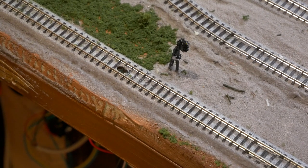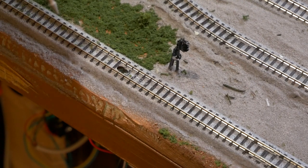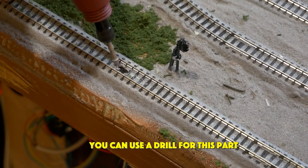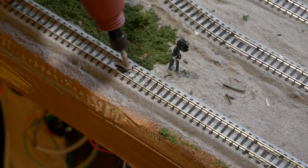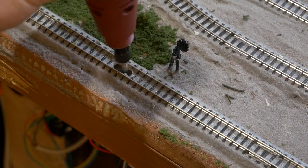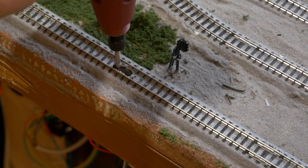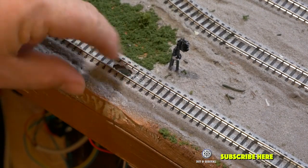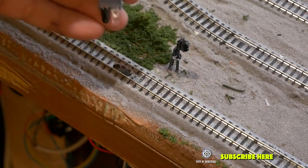Then I'm going to bring my rotary tool, which is like a Dremel — mine is a Chicago Electrics rotary tool from Harbor Freight, and I will link that in the description below. What we need to do is cut a hole that is big enough for the two bulbs of the infrared sensor to stick out. Then you clear off any debris and rubber so that it won't get in the track, and make sure that the LEDs fit.